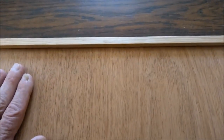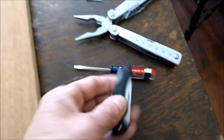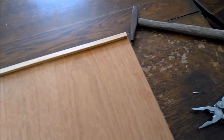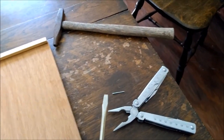And I said, I'm not going to do that. I mean, it was obvious. You could see it. Matter of fact, if you look at the early part of the video, you can see it. So what I did, and I didn't want to do it, but I'm not going to let that lay, I took my knife and very carefully cut out around. I already had some spackle in there to finish it off. I dug it out around it enough to where I could get this tiny screwdriver in underneath the edge of a finish nail.